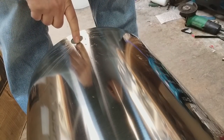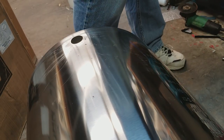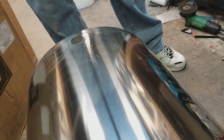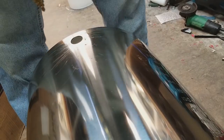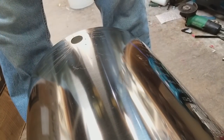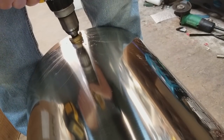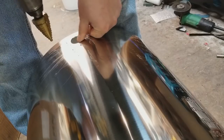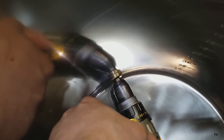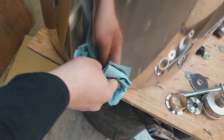That's probably five seconds of drilling time — that's what I mean, they are awesome. This makes for a little bit of a sharp edge, not too bad, but the way I like to clean that up is to use a step drill bit that goes up to inch and three-eighths and just change that out on the drill. You could certainly use a file, some sandpaper, or a deburring tool — which works really well too — but nothing beats the drill. Then I also do that on the inside of the hole.